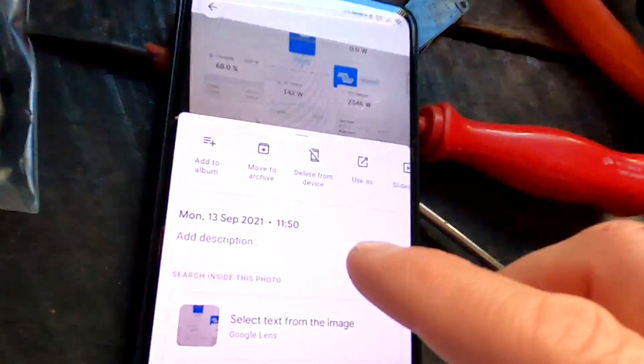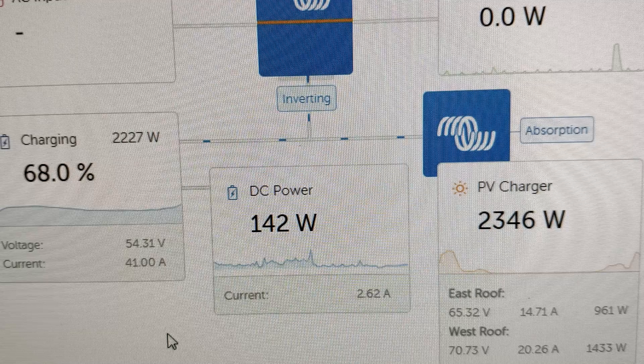We had a bit of a crazy weather situation — it's blue sky now, but earlier we had lots of thick clouds moving across. The sun kept coming and going, and we had many of these cloud-edge cases where the sun is behind a cloud and then suddenly bursts out. With the solar panels cold, I saw 60 amps for the first time — both solar charge controllers almost at maximum current. It's early spring down here, so I'm getting a rough idea of what to expect in summertime.